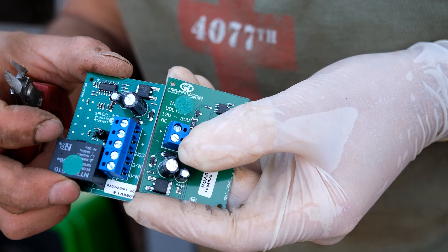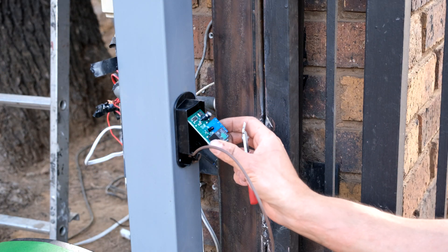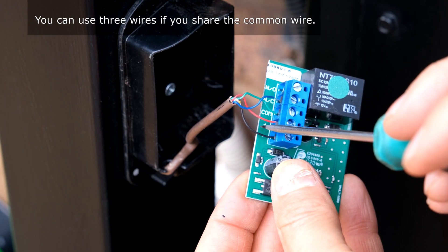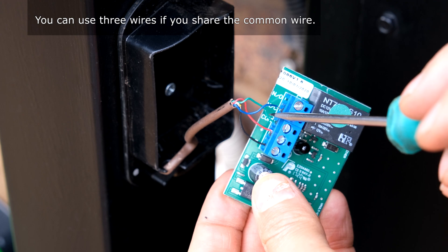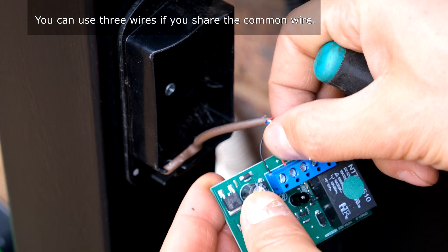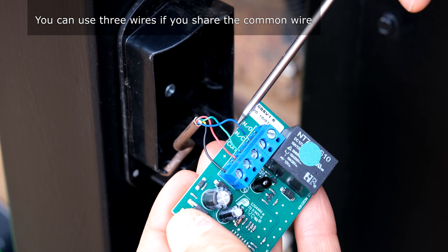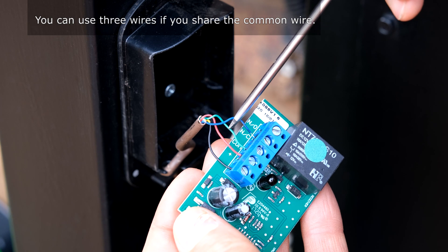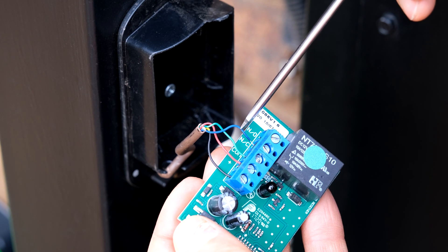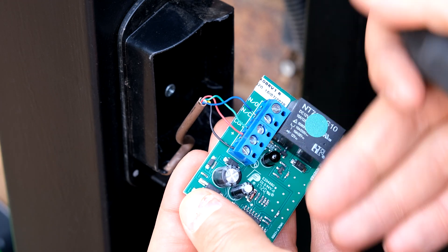So you can decide which one you want to be the transmitter and the receiver. In my case, I'm putting the receiver closer to my gate motor. I wire it up as follows: negative is the black, positive is the red. I've just used the green cable for common and then I use the normally closed option. So you can see it's normally closed. My signal wires are actually the blue and the green. I've put the green to common, so it means that when the blue is open-circuited, the default registers an obstruction in the way of the beam.